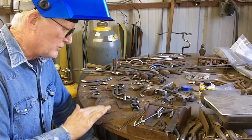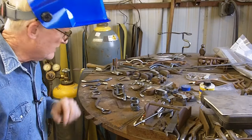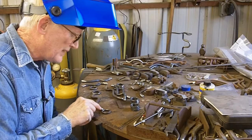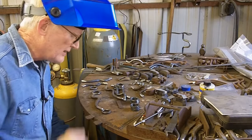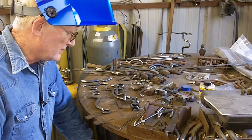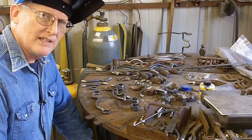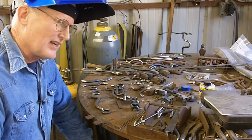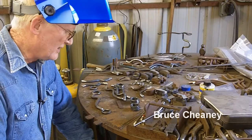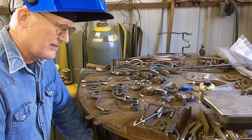I've got this ring shimmed right in the center of the bit shank. I'll start in here and weld that split up on that ring, then just walk that around. Think neatness when you're welding — try to do it as neat as you can. Examine other welds, like on a bicycle or a race car frame — you can lay it in that good and it's going to look mighty good. Another way is to put on a lot of weld and then come back and dress it down and blend the welds. You can create your own style and come up with what works for you.